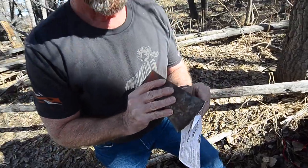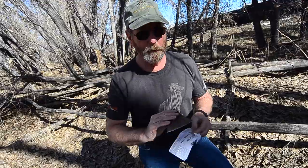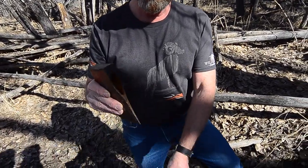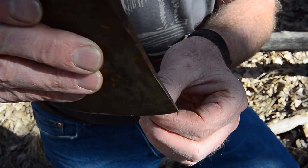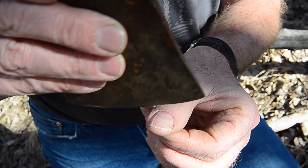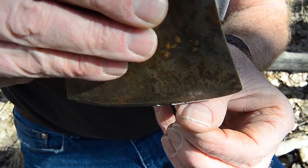That's pretty sharp. Unless you're in competition cutting, I don't think you want your axe much sharper than that, because you'll have it so thin that it'll roll the edge easy and nick easy. Here's something else we do all the time - the thumbnail test. I'm not pushing very hard at all; in fact, I'm not letting the full weight of the axe head sit on my thumbnail. You can see there's definitely thumbnail there - it catches - so that's how you know it's sharp.